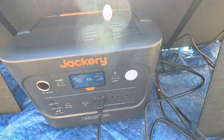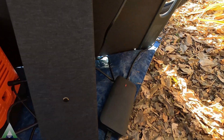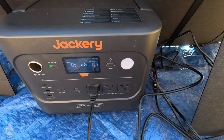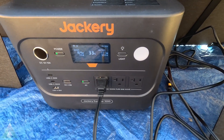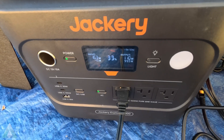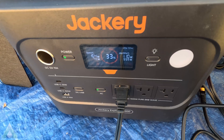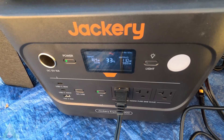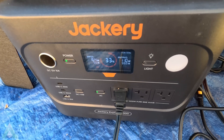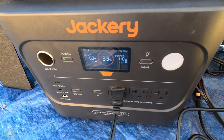These solar panels are rated for 24 volts open circuit voltage. If you're getting any solar panels, whether these or others, you need to make sure the voltage is acceptable within the limits of the power station or inverter you'll be using. There are some 12-volt solar panels out there, so it's important to ensure the right solar panel voltage can be handled by the unit being charged.